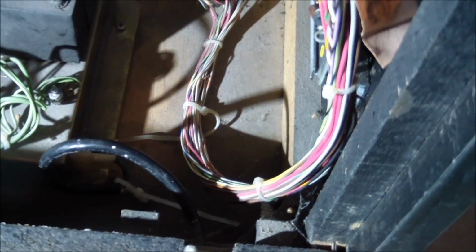So finally, my buddy was looking at it, and he called me over. Can you see that? Yeah, this is where the AC power comes in. 3 wires. You have your white, green, and black. That's directly connected to the power plug, and it goes into the main transformer over here. And the black wire over here was out. It had basically come loose from the crimp connection, so the machine wasn't getting any power at all because it wasn't hooked up to AC.